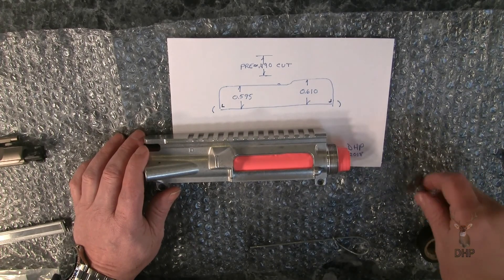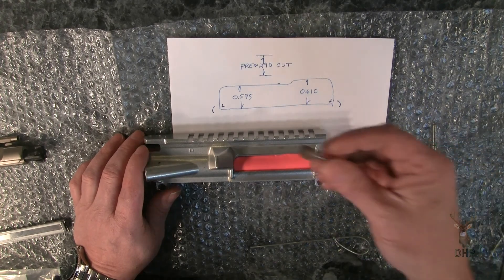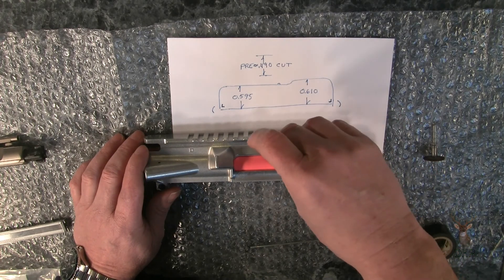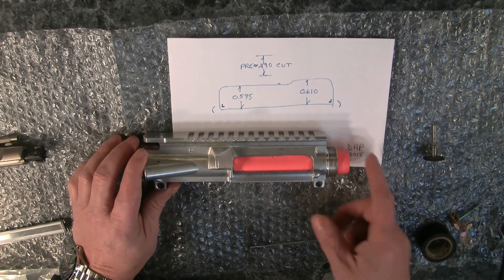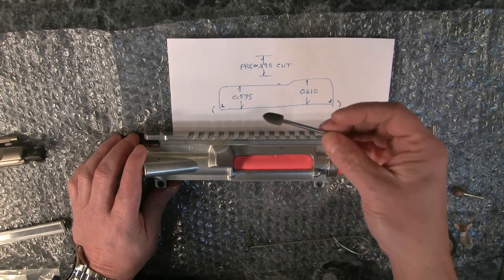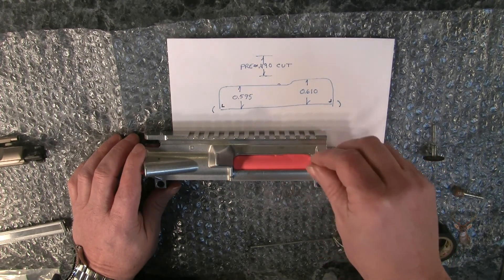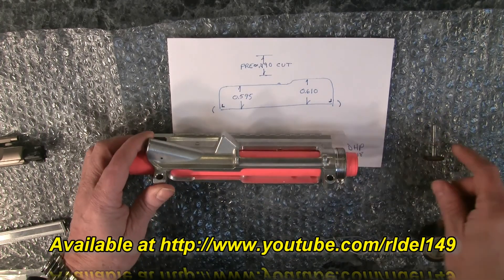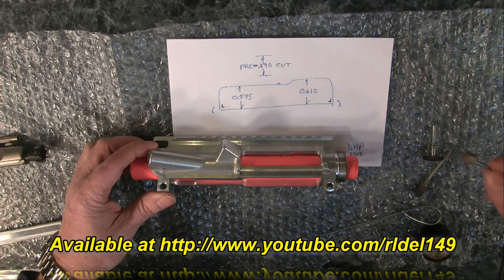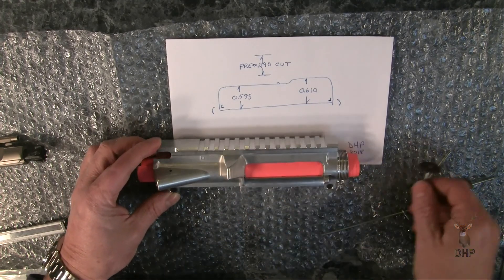On the upper, I couldn't quite get the flat disc in there while still taking some off this side, so I ended up using a little grinder and just went in there and smoothed it out. It was a little bit rougher than I wanted with the grinder, so I took a buffer wheel with buffing compound and polished the aluminum down to make a fairly smooth surface. It's a little bit uneven because I was using a grinder versus the flat wheel — I found the flat wheel actually did a really nice job.